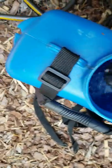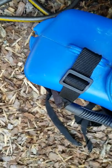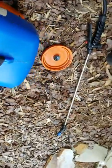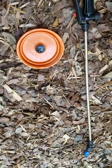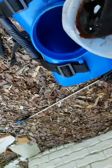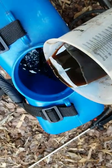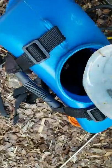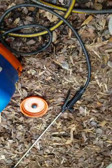On this particular sprayer it's kind of hard to see. Generally what I have to do is come over here and find the 2-gallon mark and look in there and see my finger mark. We're about riding on it right now, a little above, but that'll be okay. Mixing 4 gallons today. So I pour the chemical in there. When you pour this chemical in there, you need to make sure you rinse this cup out at least 3 times.